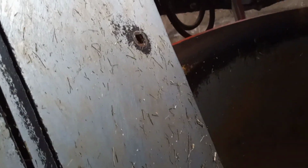So I've got the silage out that was left in, a couple of little piles there. There wasn't that much. And if you have a look inside, you can see the door's hanging off there. The runner that it runs in behind up that side looks to be okay. The heads of the bolts are getting a little bit worn, but it seems to be holding fine up that side. But up this side, you can see we've lost 1, 2, 3, 4 of the bolts that hold the metal the door runs against. So hopefully we can put the door back in and put some new bolts in there. I've one missing at this side as well. Whether I can replace that as well while we're doing it, that would be good.